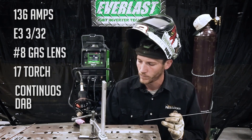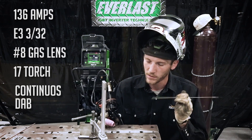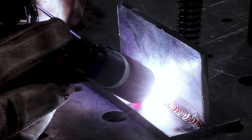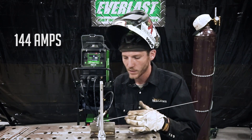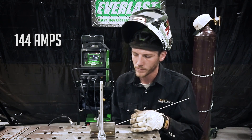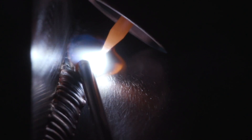This hand is going to pull at a consistent speed and then I'm going to dab. I'm going to go ahead and make a second pass on this dabbing one — I turned it up to 144 amps — going straight on top of the other one and then offset a couple. Now I'm going to do two more passes: one's going to lay in the bottom of the weld and then I'm going to stack one on top of it — two stringers.